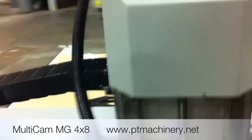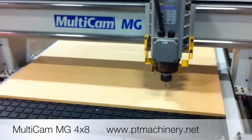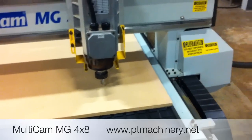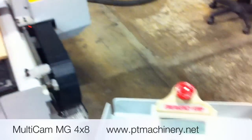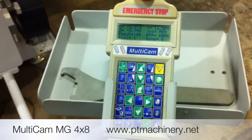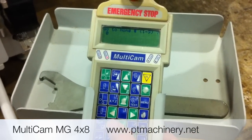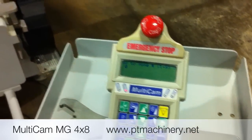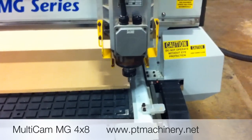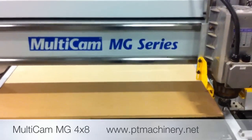Simply put this back on top and now we're ready for the next setup. The next thing I want to do is set a home position — that'll give a reference for the corner of my material. Multicam saves up to nine programmable homes. To call up my home location, I'll simply hit the house button on the bottom and then hit number one. That'll bring up position number one, and the machine moves automatically to the corner of my material. At this point, my machine is set up and ready to run.